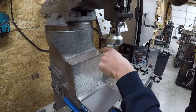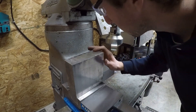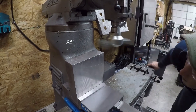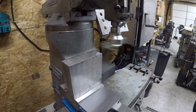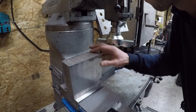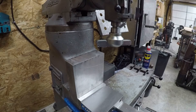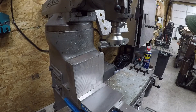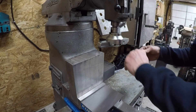Not a bad cut though, for a dry pass. That is pretty acceptable. I'll just smooth that time. That might be too fast - of course I'm doing it without lubricant too. I'm going to move this out just a little bit, see if maybe we're a little back heavy - maybe it will help the chatter.